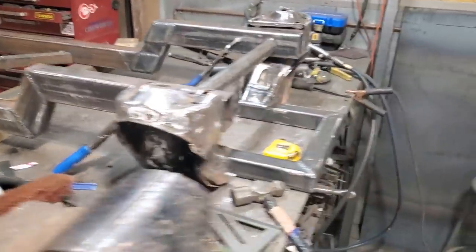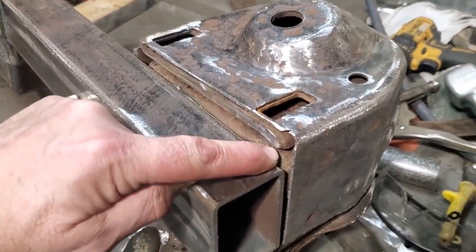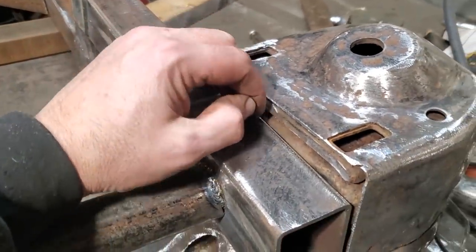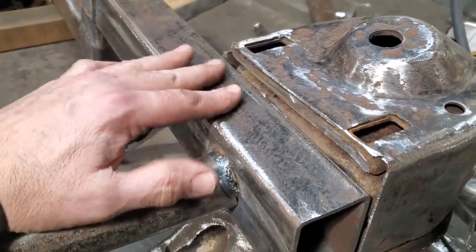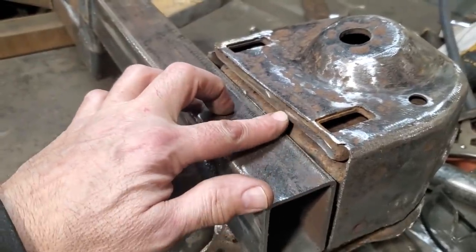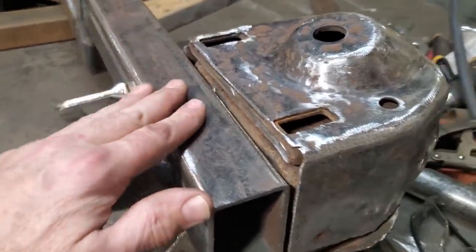So my plan now is I'm just sizing up what way I'm going to mount it and weld it. I'm going to run a bead in along here, weld it on there, weld it on there, and then plug weld these two back ones. Then I'm going to put a plate over this. I was going to put it on an angle, but I want this whole surface here for the ID I got for an engine mount. So I'm going to plate this way here and weld it on solid, because I want this here welded to this. So I'll weld this onto this first, and then I'll plate this from here down to here,